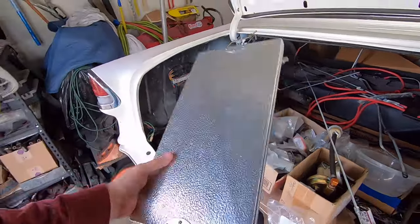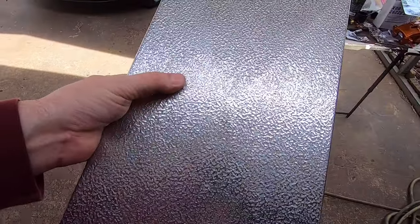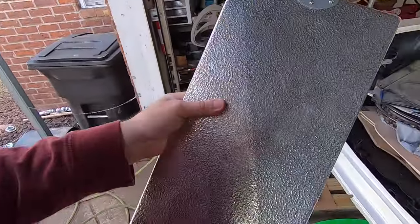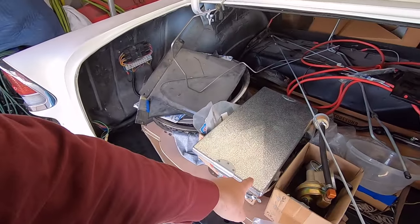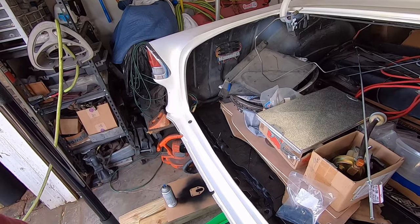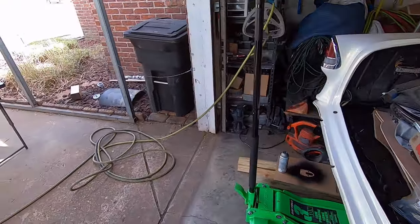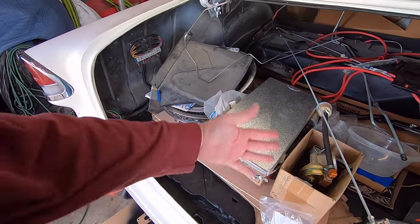I tried polishing the lid and I'm having a hell of a time with it. The design reminds me of old nugget jewelry — when you try to buff or polish it, the compound gets stuck down in the crevices and the only way to get it out is to scrub it with a toothbrush, which ends up dulling it back out. I tried doing it by hand and with a three-inch wool mini pad on an air buffer at low speed, but it just pushes the compound down in there. I can't get a mirror finish out of it.